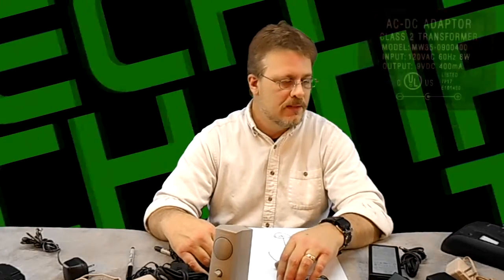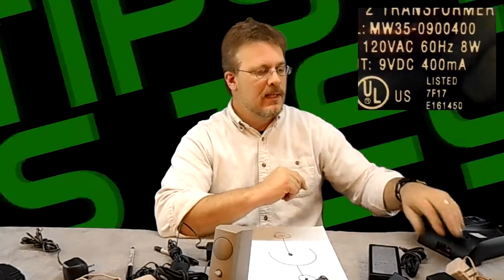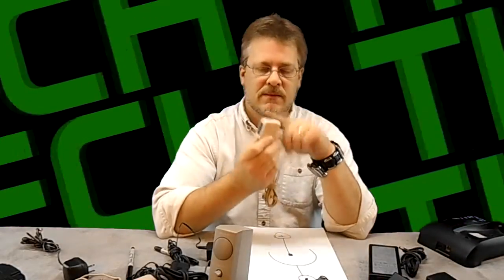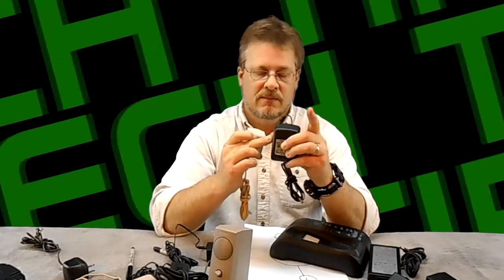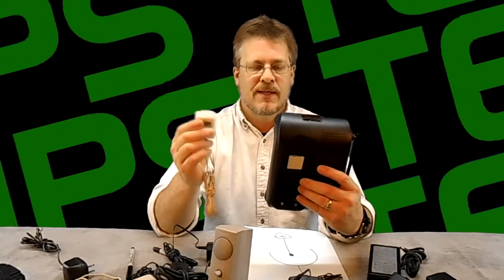The other thing that doesn't have to match exactly, but there are some rules to it, are the requirements as far as the milliamps are concerned. When you look on the device, you'll see that it requires a certain amount of milliamps or draw. All of these are rated in milliamps or amps, listed as mA. For instance, this one says 300 mA — that means this is capable of producing up to 300 milliamps. Generally, the bigger in size these are, the more they produce. So this would be a 300 and a larger one might be a 500. You want to make sure that the adapter is rated greater than or equal to the device.